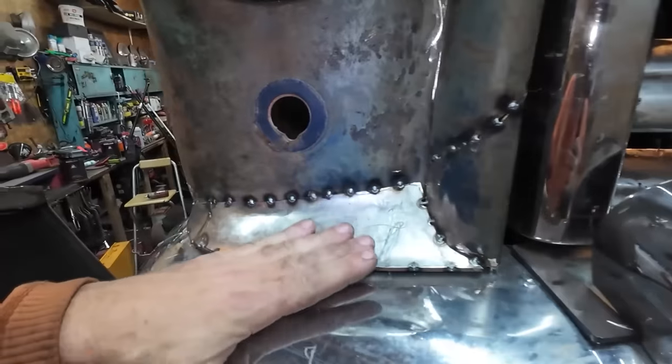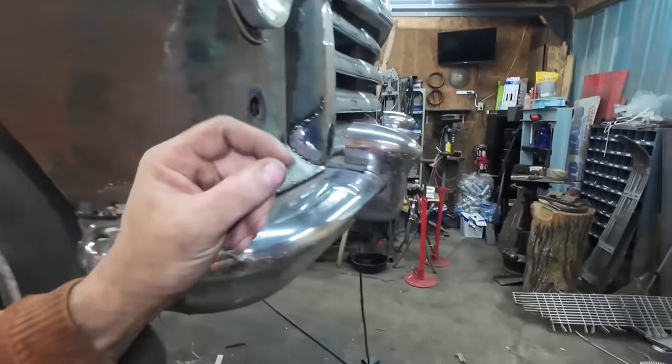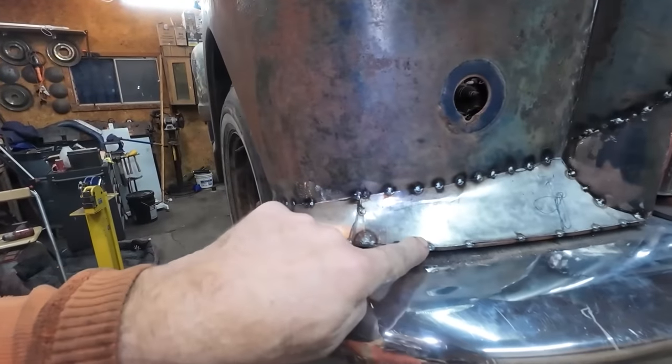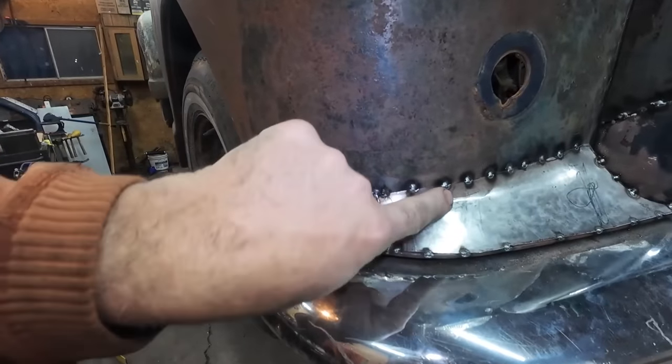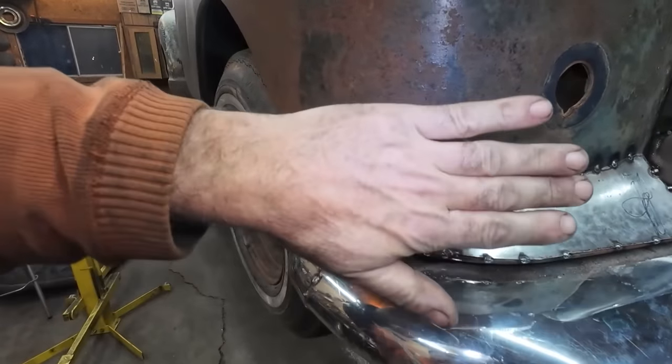Well, that was fun. I actually liked that. A little bit of half power hammer or planishing hammer action, and needed the stretcher shrinker a little bit here. We had to stretch this to go around, and I tried shrinking, but I ended up goofing that. I actually had to stretch this part too, even though it was in a perfect curve.